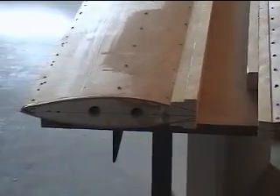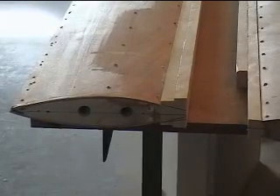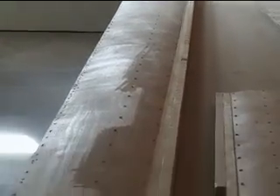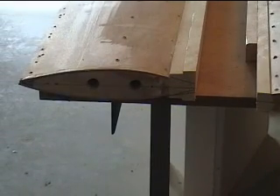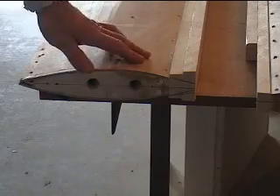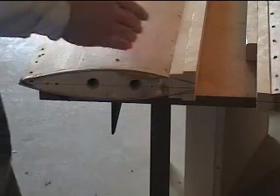What I'm going to do next is establish a line on the nose block so I can draw a line fore and aft to establish my taper mark. The way I'm going to do that first is take and plane to this line here on both sides on all the pieces. After I'm done with that I can establish a straight line this way, because I can't snap a line on this — it's too rough right now.